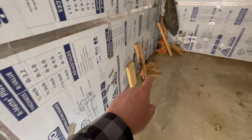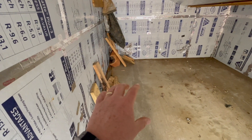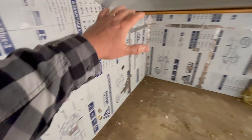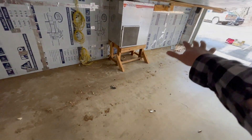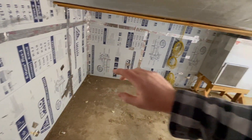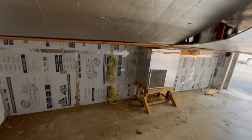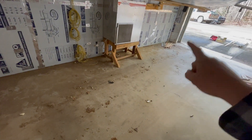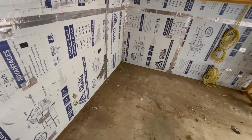You see a bunch of scrap wood sitting all over the floor — I actually use this wood to help hold things in place. In addition to using the baffles, sometimes there's a big gap and you don't want the air just going through that gap. If you have a stack of wood on the cart but didn't have enough to fill the entire kiln, you need to block the empty space so the air doesn't bypass it — it will always take the path of least resistance through the stickered pile of wood.